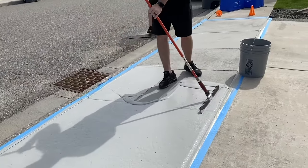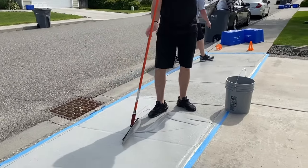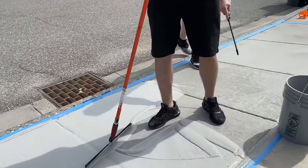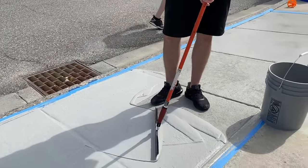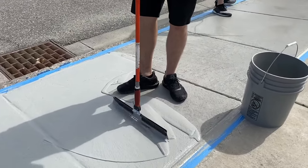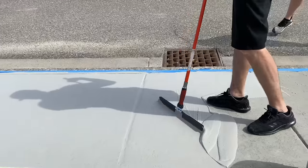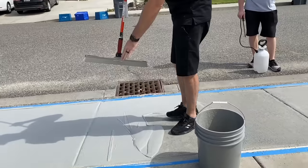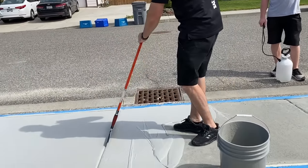And if you guys watch when I'm troweling the beads out, I'm always keeping that product kind of in the middle because I don't want it pushing out the side. So if I have product towards the end, see how it'll start to push out the side. Now I gotta come back and clean that up. So whenever I'm finishing the beads off or moving beads, I'm making sure that product really isn't going past the middle of there and it'll never push out the front of that.